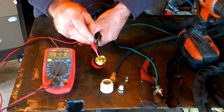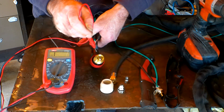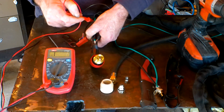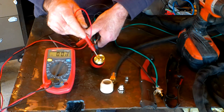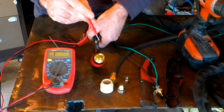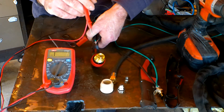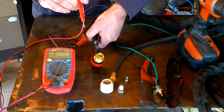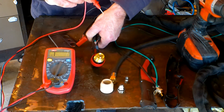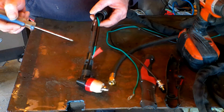So what it's basically telling us is that from where this wire goes in, through the gun, you've got a direct short that comes up and goes to the outside of our plasma torch head. But if we touch it on the inside where the electrode screws in - absolutely nothing. So this wire is connected to the outside of our cutting tip, not to the inside of the electrode. I've got a couple of videos on how to do a quick pilot arc conversion if you haven't got pilot arc - I'll put those links in the description.